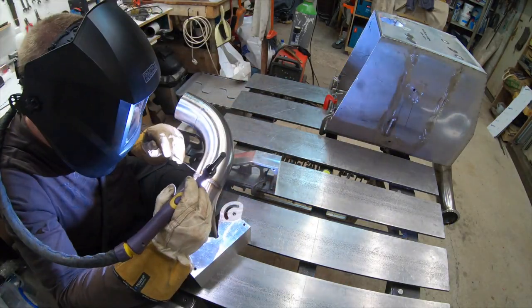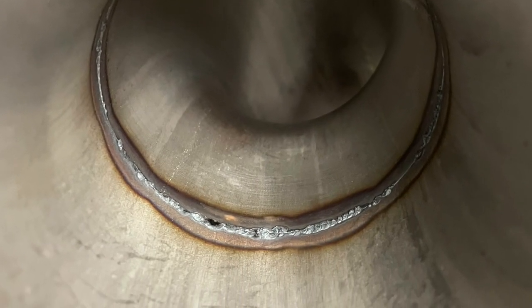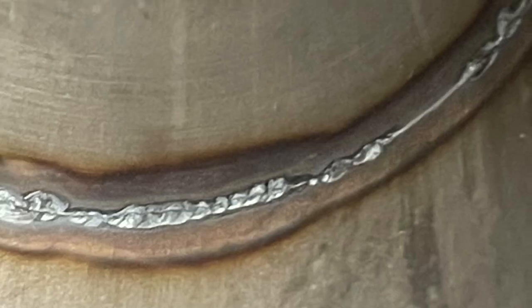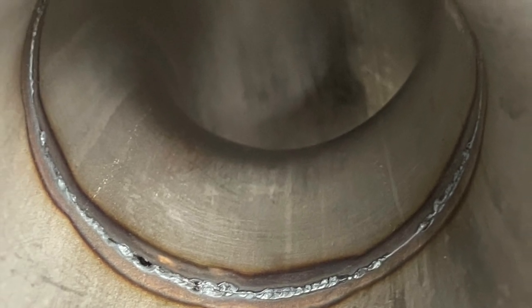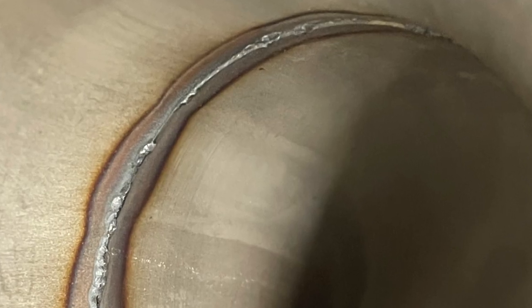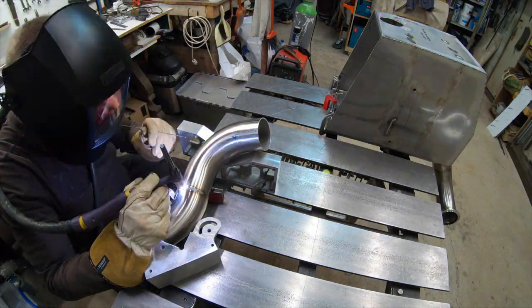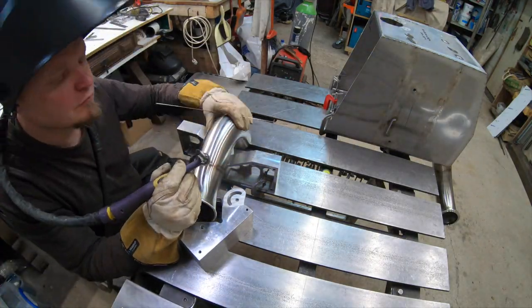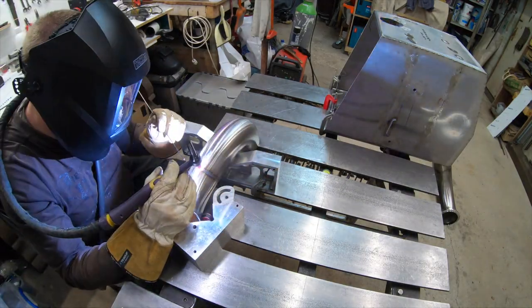For the YouTube certified engineers out there, this is what it looks like inside the welded tubes. Filling the tubes with argon would make the surface look as pretty as the outside. With added strength, stainless steel forms nasty crystals when it comes in contact with the atmosphere. But as you can see, it's not very bad in this case. And as I said in the first part, I don't have the time, money or equipment to do back purging, so this will have to do.